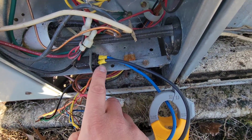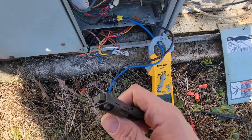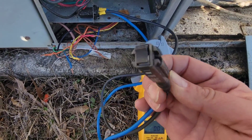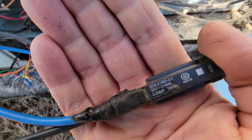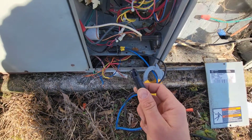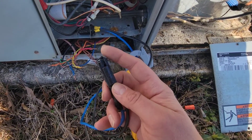So we would have a fuse here, but I'm not going to put this fuse back in because I don't want to have to replace that fuse every time. I've got a little resettable here — this is really nice. You can see it's three amp. Pick one of these up, they're great. So until we find out where the short is, we don't have to replace a fuse every time it pops — this will just pop out.